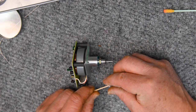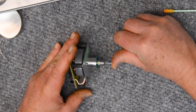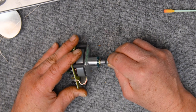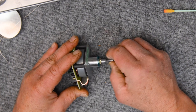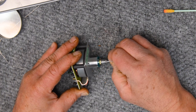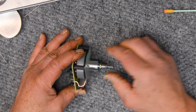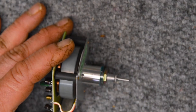And I think everybody knows or should know that these should be held off of the bearing by, you know, a millimeter, something like that, a few thousandths. And see, there's some of those times when that capstan gets slammed up against that inside bearing, just like this, when you're moving that. And so that's why I put that little drop of grease in there. That's about how it should be. You know, half a millimeter, 20 thousandths, something like that.